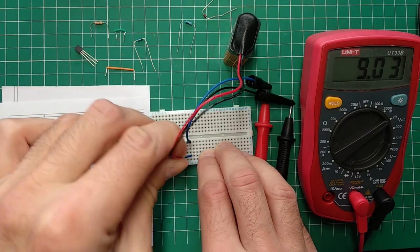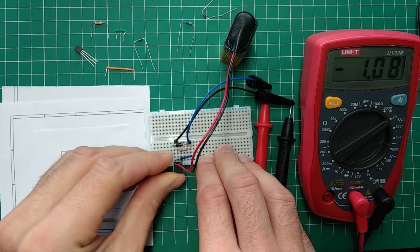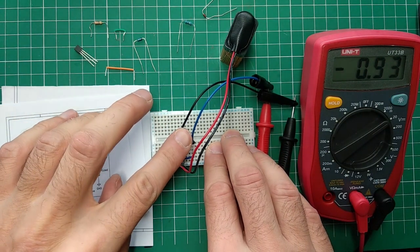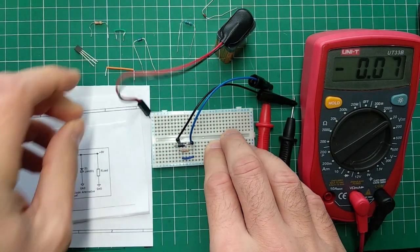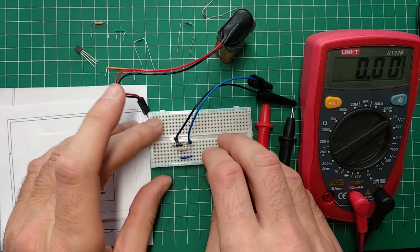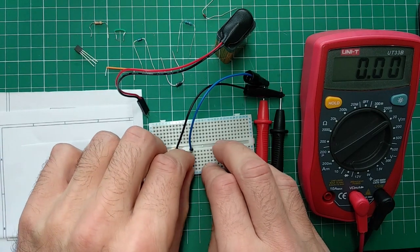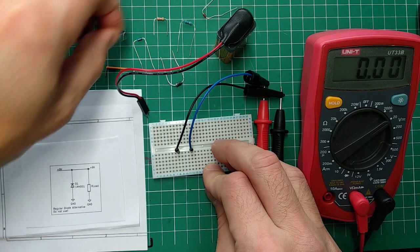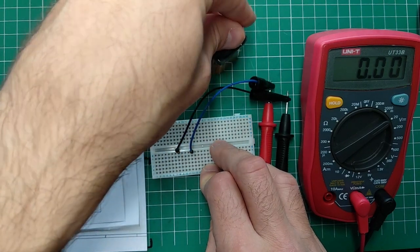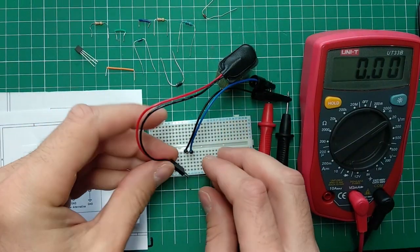What is interesting is if we switch this around and we reverse polarity, now the diode will start conducting. It will be on. So I'm just doing that now. There is a slight drop, but you know, here it's fine, and it's dropping because it's actually getting really hot. What's happening is, and I'll just wait for this to cool down a bit. There's no limit to this current, okay? So as much as the battery can give, and the battery is also a tiny bit warm, as much current as the battery can give can flow through this, okay?